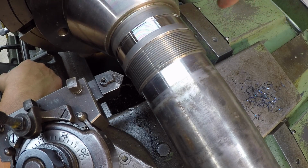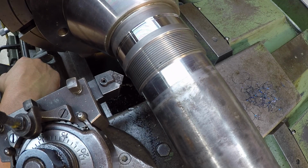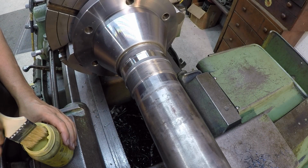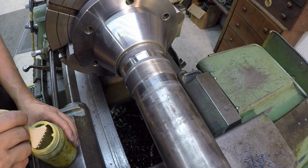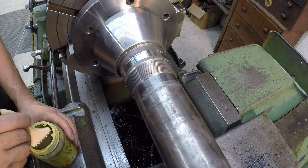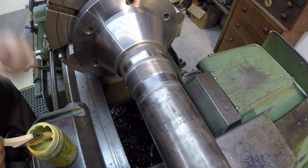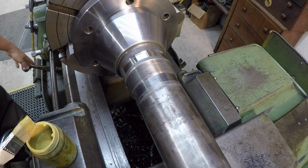I was just cutting a bevel there to cut that edge off. That might be just solid material. In that case, let me get in there and do my proper undercutting that I need to do. So I'm going to go ahead and prep it like we're going to spray weld it, and then do my undercut. And if I am mistaken that it is a sleeve in there, as soon as I start doing some preheat here, you'll see it start heating up, and I'll know that I got to stop and just go ahead and turn that off there.